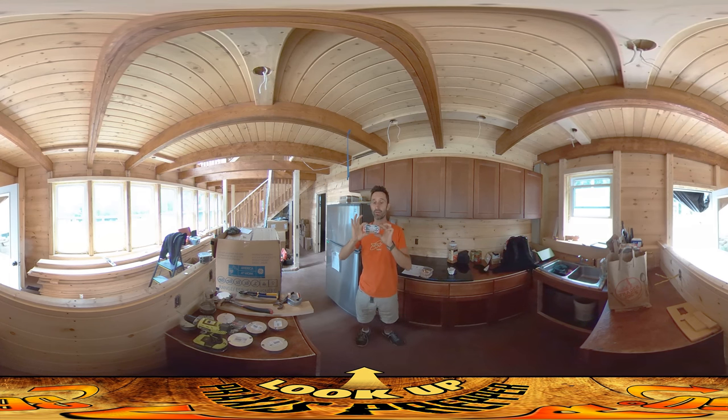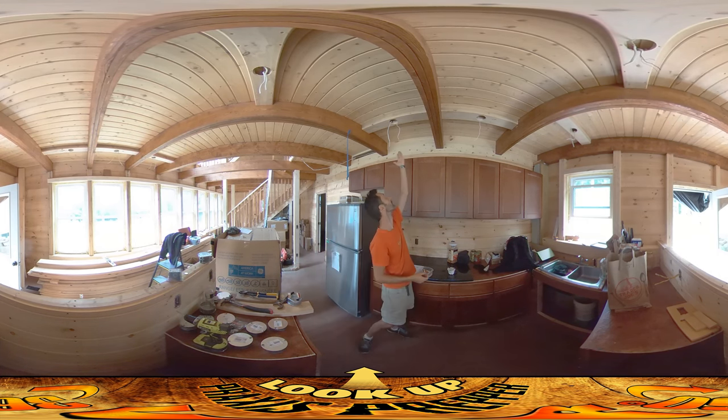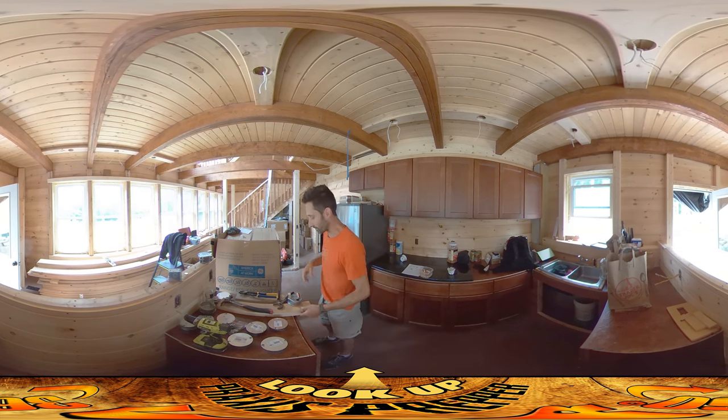In reality, this box would be totally fine for the lights that we're putting up — no big deal at all. But the idea is that someday you might want to hang a super heavy chandelier or a fan from there, and this box is questionable as to whether or not it could hold that up safely. I don't plan on doing that, but it's just the rules and we've got to follow them in order to get approved by the inspectors.